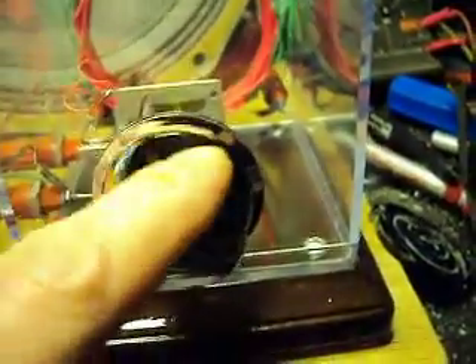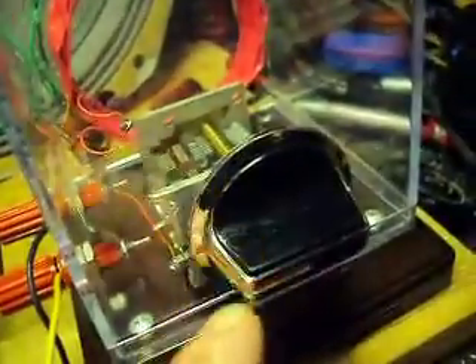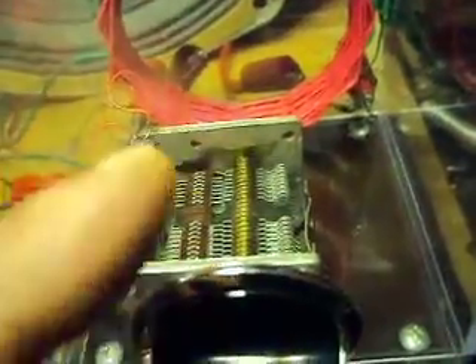That's the crystal set. I just love this ugly old heater knob — I wish it were in better condition, there's a little chrome flaking here and there, but it kind of goes with the gaudy coils to have a big gaudy knob on this. I've loosened the variable capacitor so it's easy to turn by spreading the frame out in a vise, cleaning it up to where it didn't bind down on the bearings as much, still made good contact, and didn't have too much slack in the bearings.